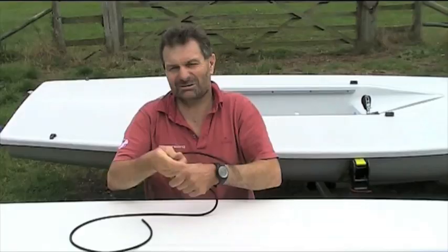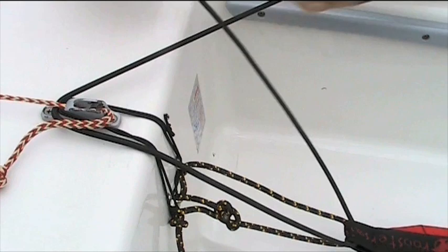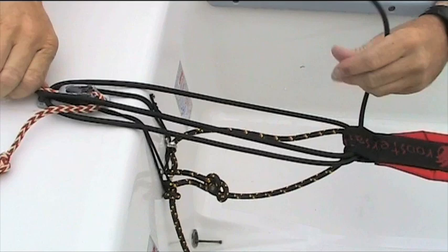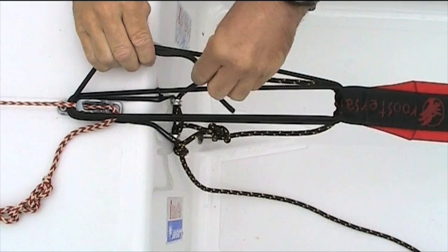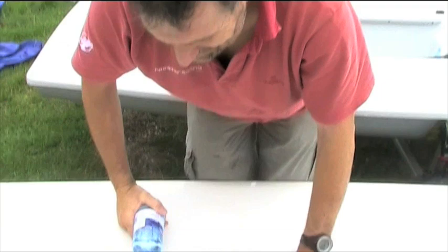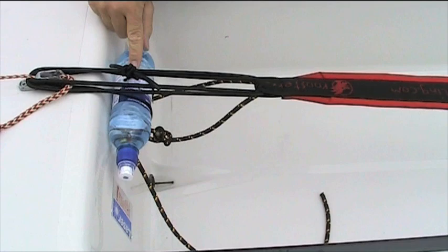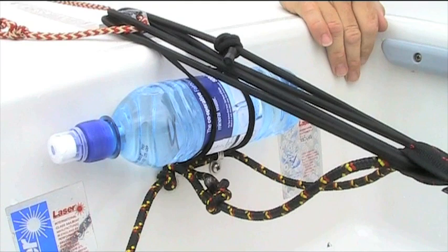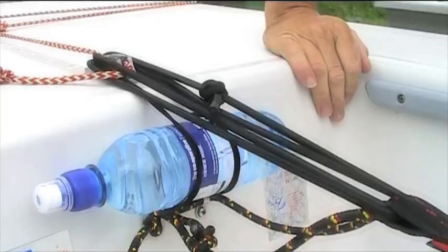The toe strap elastic goes through your toe strap and around the back of your traveller — it's a twice-round, with any sort of knot you like. So long as you use a separate piece of elastic, because the Laser Class rules say you're not allowed to use that elastic to hold the water bottle in for two purposes. You can put in a little bit of thin elastic between the cleat and the fitting, and you've got a nice water bottle holder. The nice thing is, instead of putting it around the mast where the boat going up and down every wave creates massive movement and the water bottle pounds the waves, this part of the boat stays fairly stationary, so you don't get too much pounding with extra weight there.